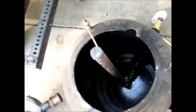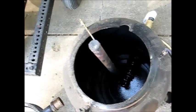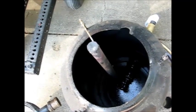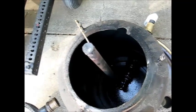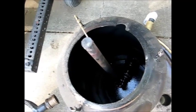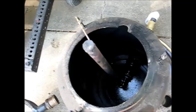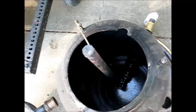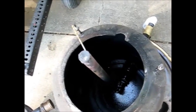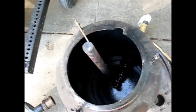If you get this too aggressive, you'll be providing too much oxygen and not restricting the air. This is a restricted air combustion process, so too much air is not good. What you want to do is restrict the amount of air going in so that it gets hot enough but yet doesn't burn your gas up. So it's a balancing act, so to speak.